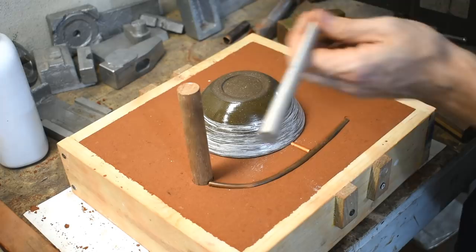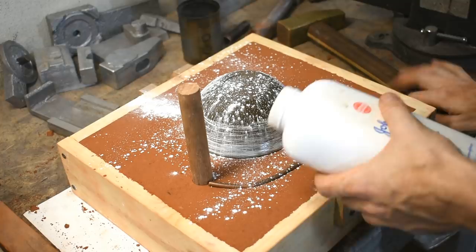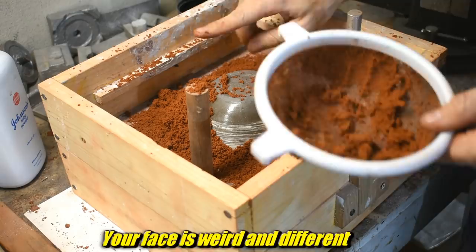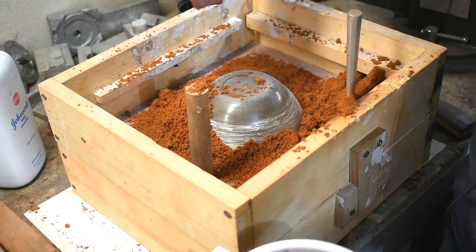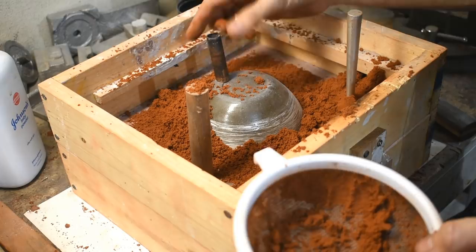One of the rules was that the work be signed. I usually sign with this blacksmith maker's mark — I push it into the clay when it's leather hard. But we're going to do something different: I'm going to try stamping the sand, because that seems more fun. Just so you know, where I talked about the extra thickness around this part — I am going to use a feeder, made out of copper tube, and it just sets there. I'm going to do reverse gravity feed again, tipping this side up so the metal will flow up and the very last part that gets metal will be this side of the foot ring. So I'm putting the feeder right there, and I'll have to grind that off and clean it up afterwards to get a decent looking finished bowl.